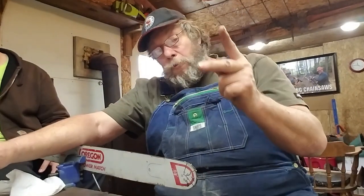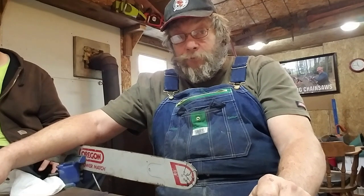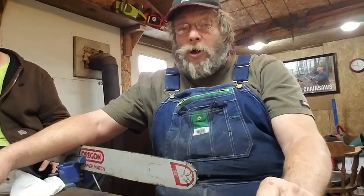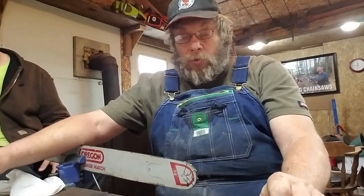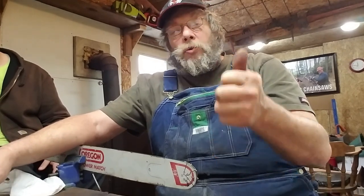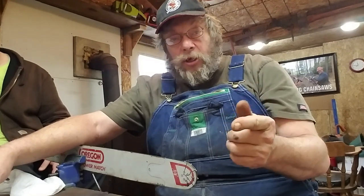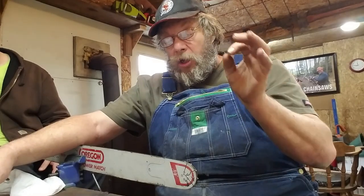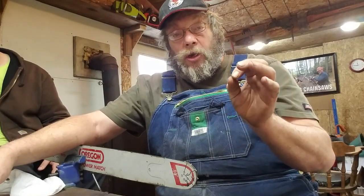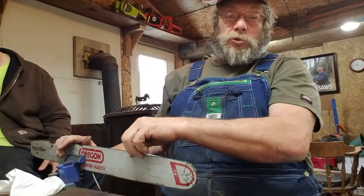The two places, you know I port saws. I'm going to tell you how to get more power out of your saw than a port job, as a rule. Learn how to maintain your chain properly and your chain tension properly. So that, number one, it's cutting to its optimum. Number two, the darn thing isn't binding up going chunk, chunk, chunk.